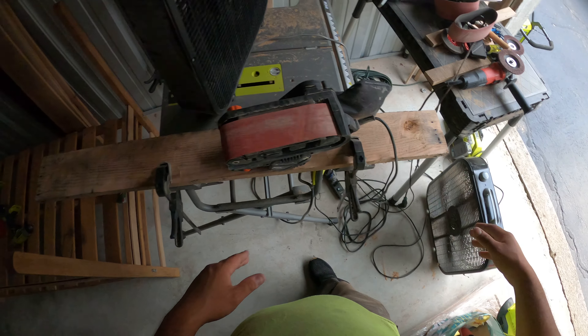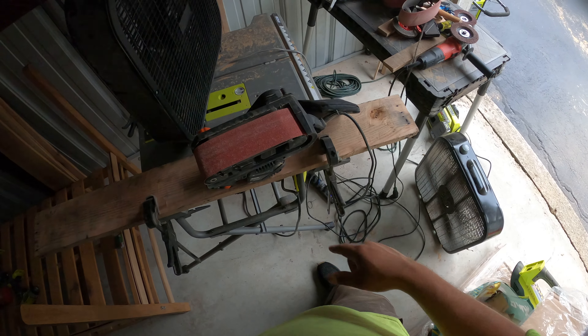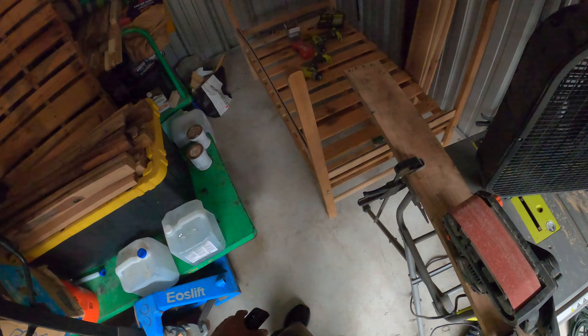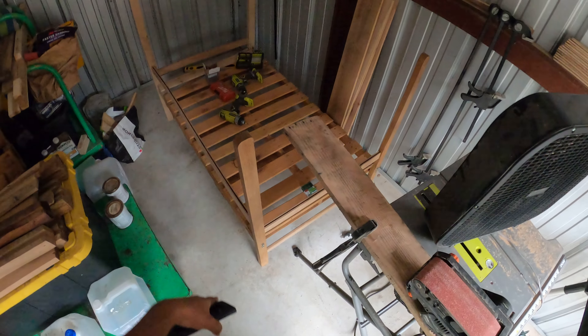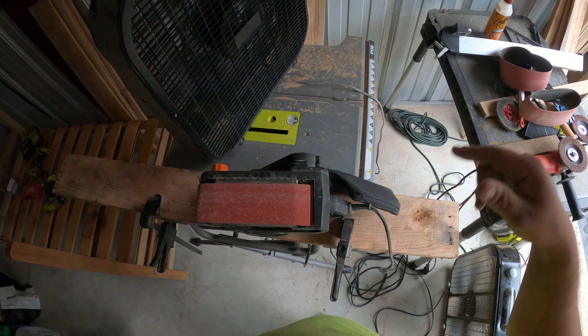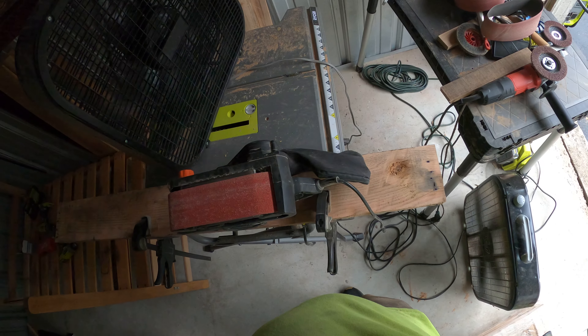So this is a 21 inch belt sander — this is 120 grit. I think this is the 80 grit one and this is the 50 grit one. The lower the number, the more abrasive it is. I'm gonna start with the 50, not the 80, because you want to work your way up in the grits. Since that was a 36, this still removes some of that wood — you want to get it pretty flat.